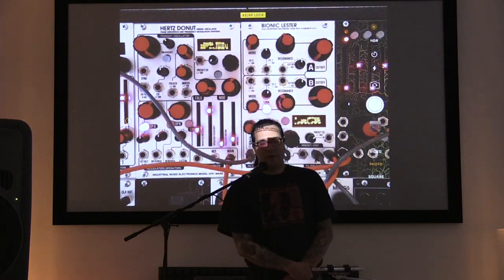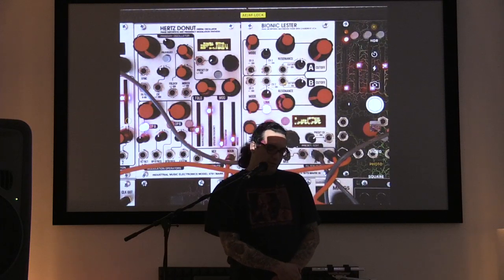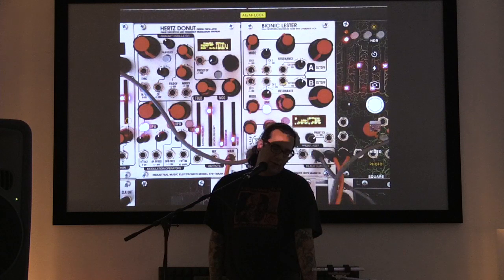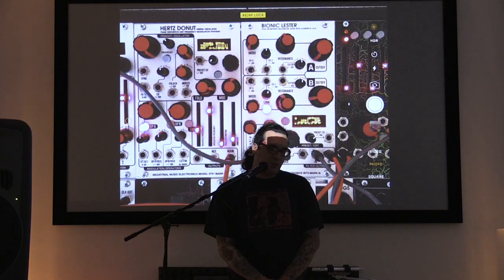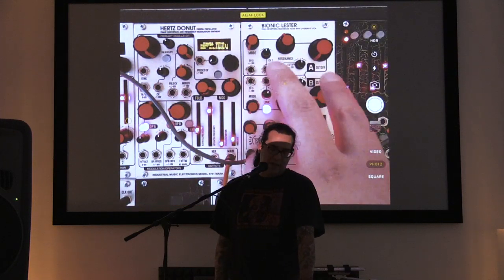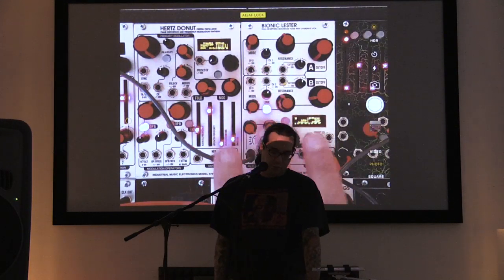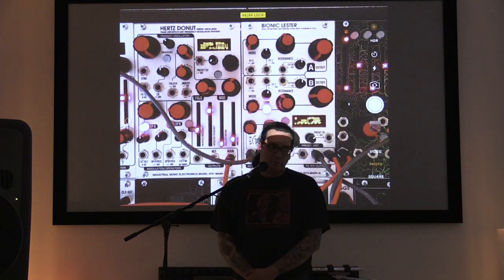The last of the link modes is called stereo. In this mode, there is no routing from output A to input B. You have a completely independent signal path on the A and B channels. Instead, you just have the controls of A copied to B as before, but with the ability to add a little offset from the B controls as we did in the former A control mode.